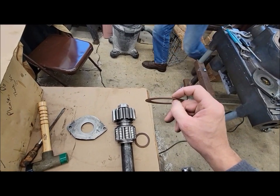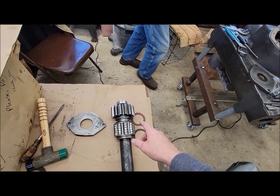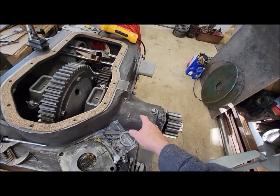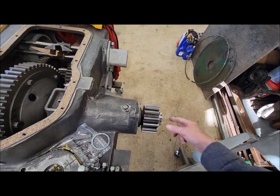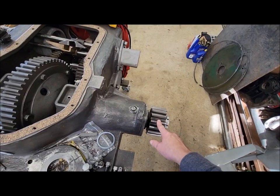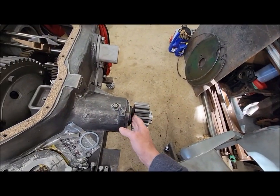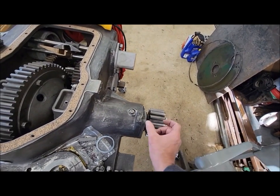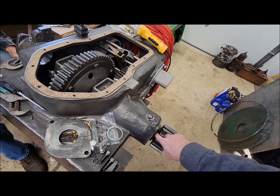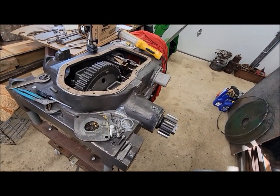Like I said, we need something 100 thou thick for these particular washers. I had one friend ask if it needed to be sealing. It doesn't really need to be a sealing surface at all, because even if it does leak, it's just going from the transmission into your final drive housing. And if that lube goes back and forth, that's no big deal. It's actually probably a good thing to lube all those washers and parts. It's not going to leak out of the tractor because that's inside of those backer plates. So it doesn't need to be sealing. It's basically just a wear surface to keep that axle running where it should be, left to right. So if anybody has any advice on that, suggestions, sources for it even, leave a comment below or let me know. I'd gladly like to get some advice there.